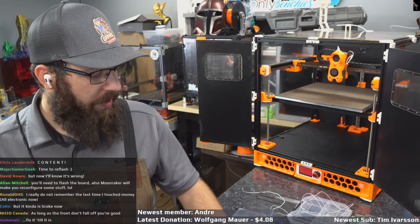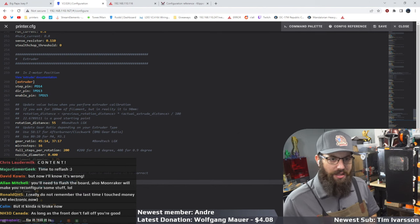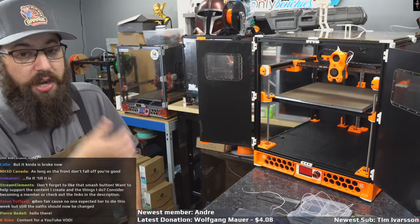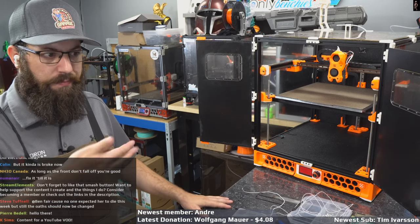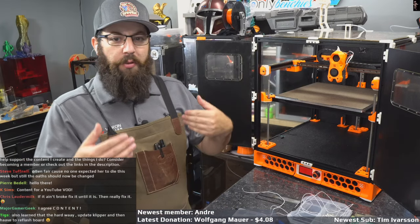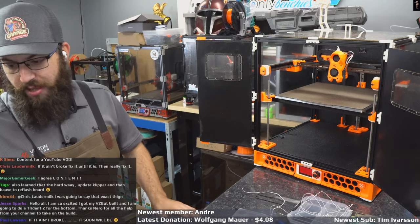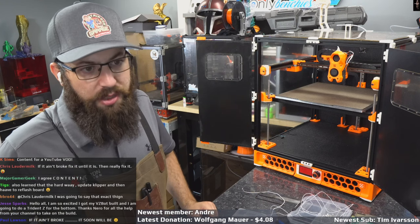Oh, that's why, okay. Because when I got the Revo, the 104NT wasn't in the Klipper docs at the time. So we all used this value and it worked fine. And then since then, the new version has come out. So that's why I'm running GT on all my machines, because I've just been copying the same thermistor type from that machine. So when I got my beta unit and the rest of the guys on the Voron team got our beta units, the NT version wasn't in Klipper yet. So that makes sense why I'm running GT instead of NT. But if you got the new version, you might as well run it.